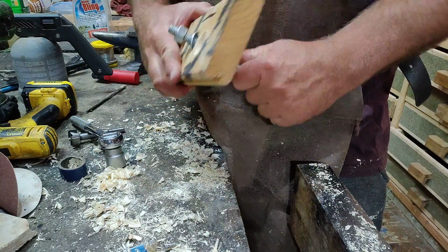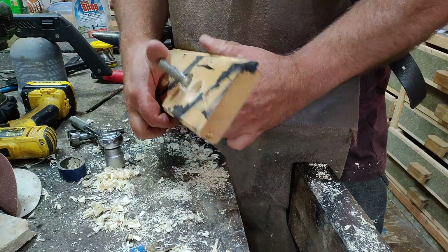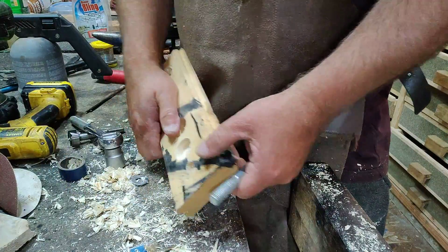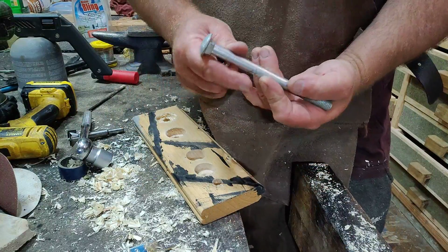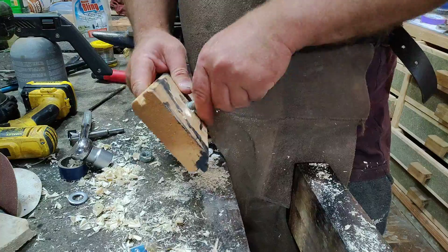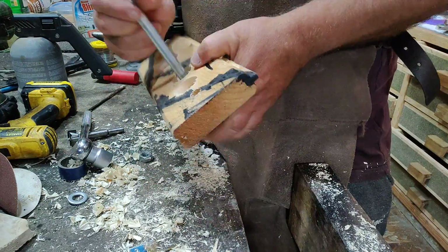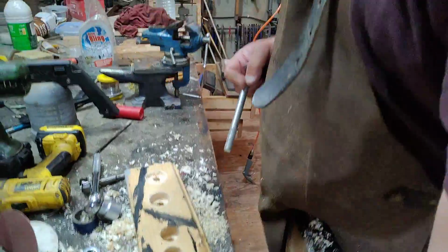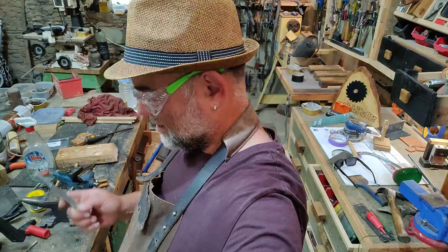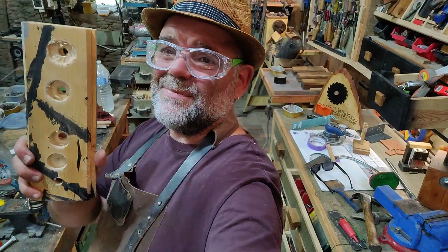It's so simple. You do your countersink before you do anything at all, if you want to sink your nut or the head, with or without a washer. You could even be using timber connectors. So if that was in there like so, it's so much neater. It's a no brainer. If you know how to do it, you're not going to make those silly mistakes, especially if you made that mistake once and you ended up with that nasty mess.